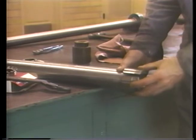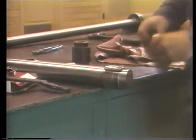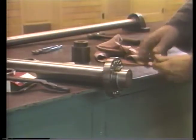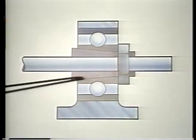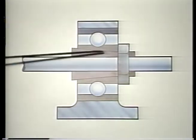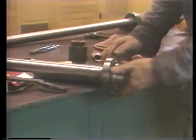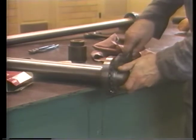Large bearings often use a tapered adapter sleeve. The tightness of the fit is adjustable with the nut, which forces the bearing inner race tighter on the tapered sleeve. A tight fit expands the inner race and takes up some of the clearance built into the bearing. Bearings are usually available with extra internal clearance if the inner race must be fitted very tightly.